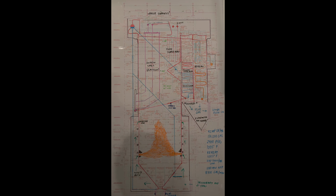Okay, this is the operational part of our pulverized coal-fired boiler. Down here you have your secondary air that comes in, wind box. Quite a bit of dust builds up because it's coming off the air preheaters, taking up dust. The air feeds up here to your burners. This is the secondary air coming in through your sleeve dampers.